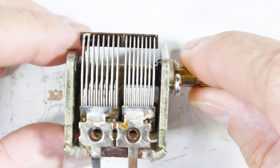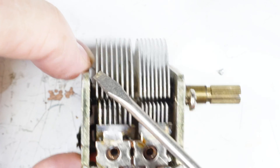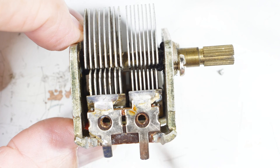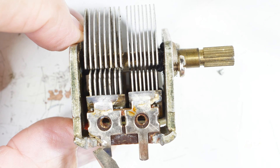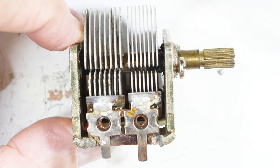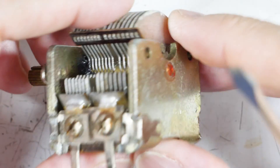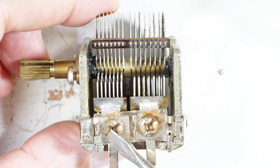The other side of the circuit are the static plates, which we can see down here. The movable plates have been rolled out of the way and the static plates are here. You connect to the static plates via these connectors right here, and they should be clear of the frame. I just found one today where I had to cut away part of this contact because it was touching the frame and shorting out the capacitor.